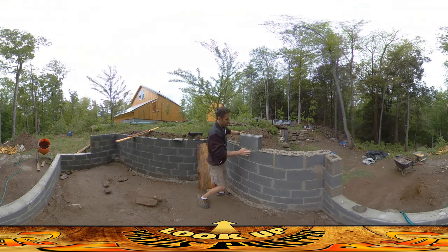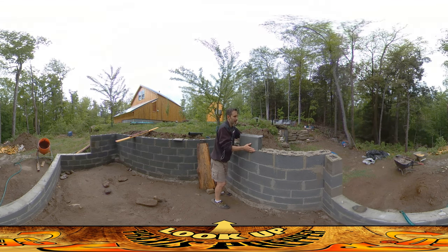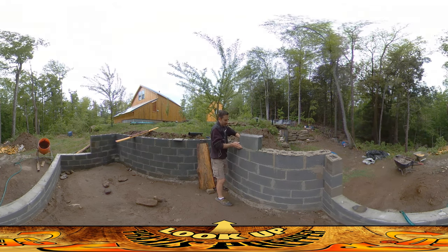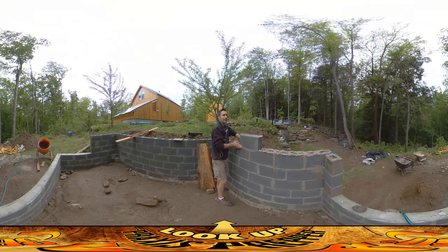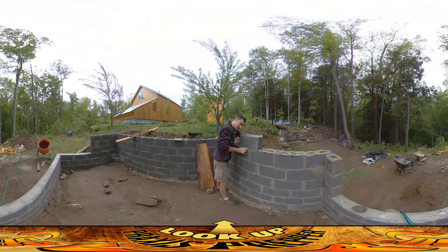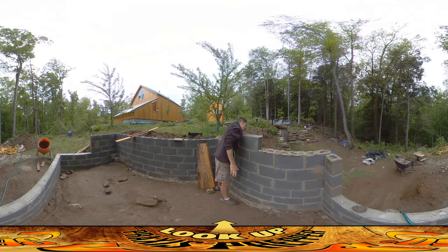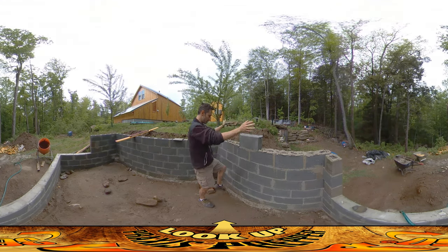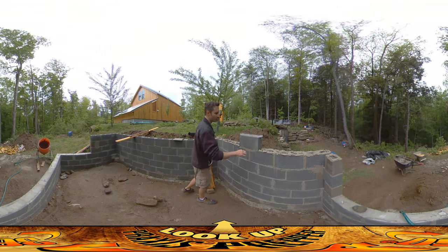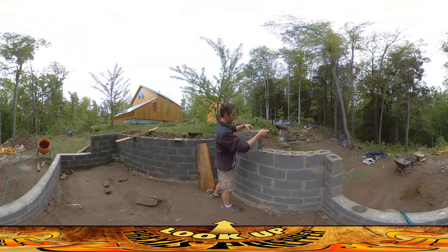At this point I just want to make sure it's nice straight up and down, so I use my fingers to feel and make sure it's nice and flush. You can sight down along the edge, close one eye, look down along the edge and just make sure it looks nice and flat and straight — and it does. So that's as high as this wall is going to be. I'm going to continue off in both directions allowing the mortar to get a little thicker as I go, judging it based on the level. Getting there — thanks for watching.